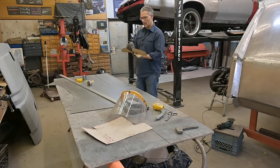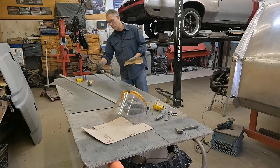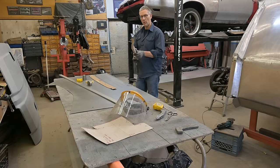Earlier I had mentioned using a vertical web with a flange on top, flange on the bottom. The flange on top picks up a separate piece that extends back to pick up the back edge of the hood. Well, I decided to extend the two channels we have on the sides with a channel across the center. A little more work, a little heavier, but a lot stronger.